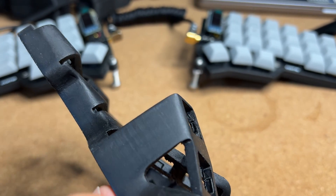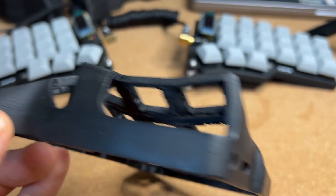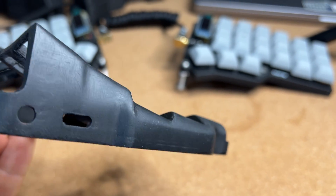Afterwards, I just printed it as recommended — I should have read the comments better. 0.15 millimeter layer height, and it looks quite nice. I assume when you put it together you don't see the inaccuracies anymore anyway, so I will just put it together with this layer height. Also, a colleague of mine sent me the six-column layer version, which also looks really nice — the six-column version, also with the PCBs. So I'll probably build two of them just to have both working, because it is fun building keyboards.